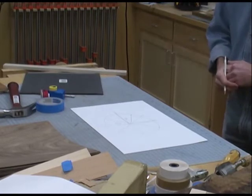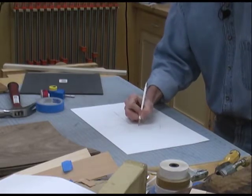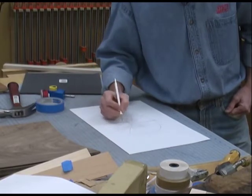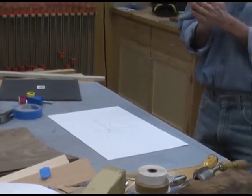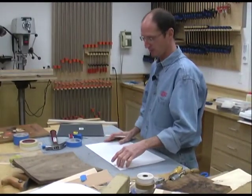Ultimately we have to add up to 360 degrees. A 16-way match has each piece at 22.5 degrees, and a 24-way match has each piece at 15 degrees. Each piece of the pie tells me the specific angle, and more importantly, how many pieces I need to make a perfect radial match.